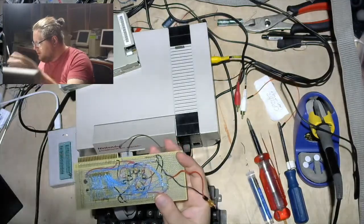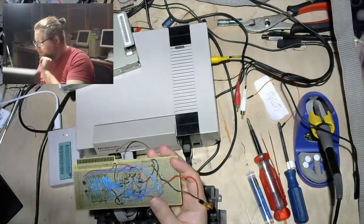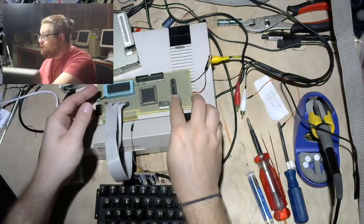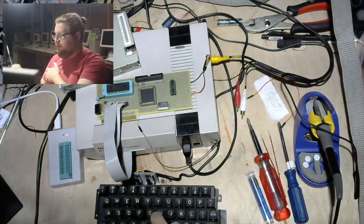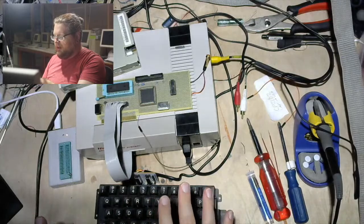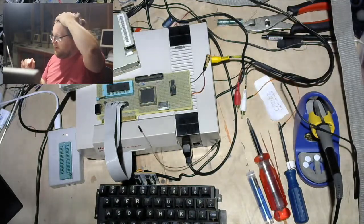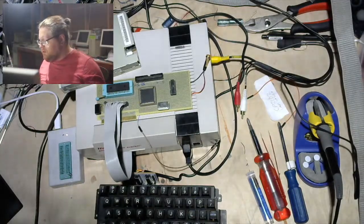Cat hair. Which I think is maybe this one. I'll have to double check. But just unsoldering 5 volts from that and connecting it to ground, we'll have to check the data sheet. But I think that should be enough to switch it into PS2 mode, which is actually what it should be in. I think I was just paranoid when I first built this board, and I thought AT mode would be the simplest way to go, and I didn't realize I don't think AT mode properly supports 1.44 megabyte floppies, or at least it's weird. So anyway, clearly PS2 mode is the way that we should have it, and I think that's all I really need to do for that.